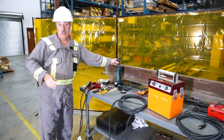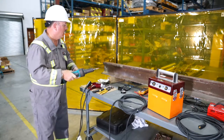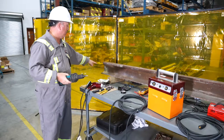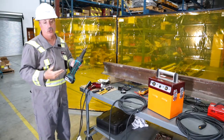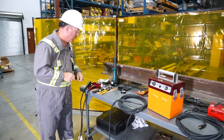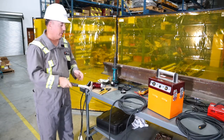And last but not least, your rail bond that you want to attach. From an equipment perspective, additional equipment you'll need is obviously a grinder to grind your spot for your ground and the spot where you're going to attach your rail bond. When I do the shot, I've already pre-ground both the rail and the location. You'll also need a hammer to knock off the excess when you're done.